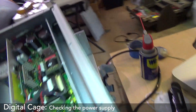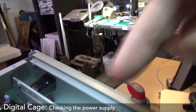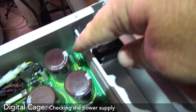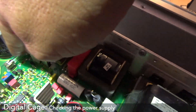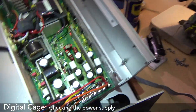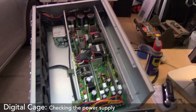I wanted to check the power supply. There was a nut inside here, which is not good. And I realised that there was a piece of plastic that fell out when I opened this box up, and the circuit board had come away, and this whole thing had risen up. These two restraining springs were flat against these two, and this was blown. The exterior one was blown too. Both Peter and Andre say don't use this power supply, get a new one, because the modern ones are way better. But at least I'll try this one out.